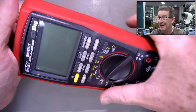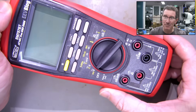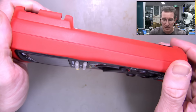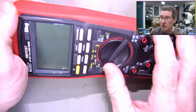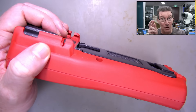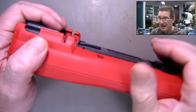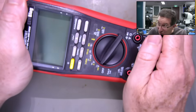Well, it's one of those bloody days again. I was putting back together the BM787BT multimeter, the new one, after I did some high-res photos of it, and it didn't work. It just wouldn't switch on at all. So I took it back apart, then I realized I got one of the board-to-board interconnect headers not lined up — it bent off to the side, didn't go into the header. So I fixed that, put it back together, and it still doesn't work!